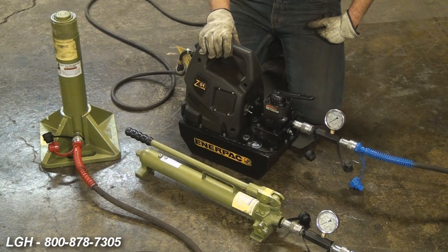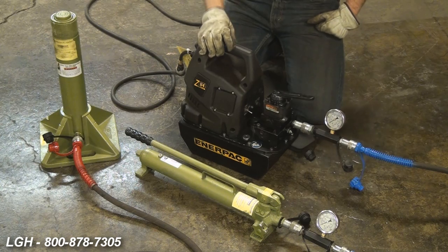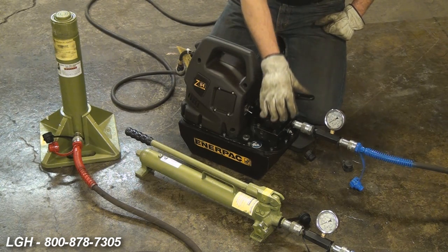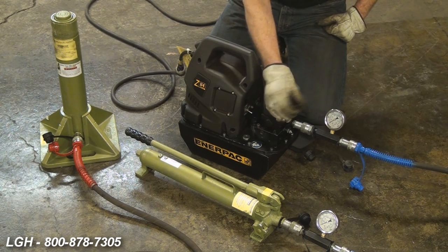A pressure gauge simply provides a window into your hydraulic system. In a moment, we'll show you how to properly hook the hoses up to the pump and the cylinder. Assuming those connections are properly made and all couplings are tight, here are some basic functions of the pump. Whether or not you're using a gas or electric pump, there's a toggle switch that will power the motor on. The neutral position of the valve is in the center. To advance the cylinder, you'd move it to your left; to retract it, you'd move it to your right.